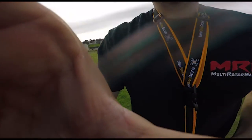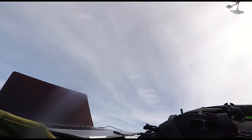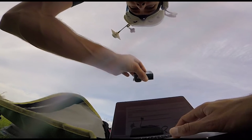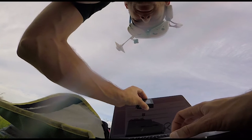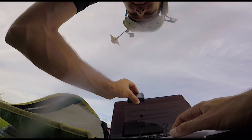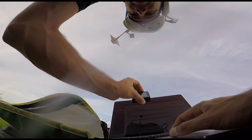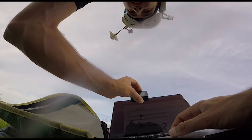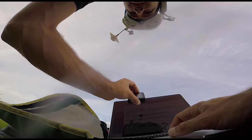So that's some good chase there with the Rosfeld 5-inch. Definitely a test of the Reaper's potential. That's a fast frame. All right, so we're gonna bump the D up a little bit more, up to 33. And I'm not really sure what I does, but let's bump it up. And then I'm gonna turn the yaw P down a little bit.